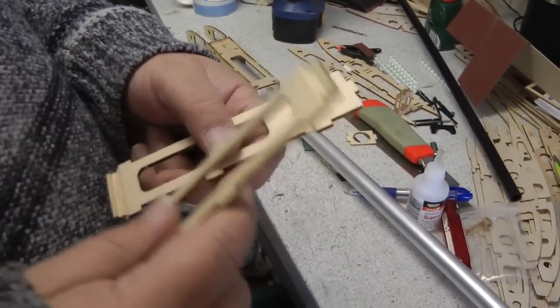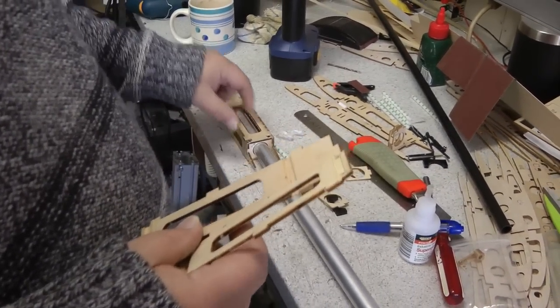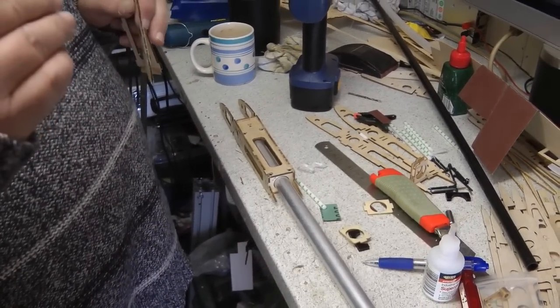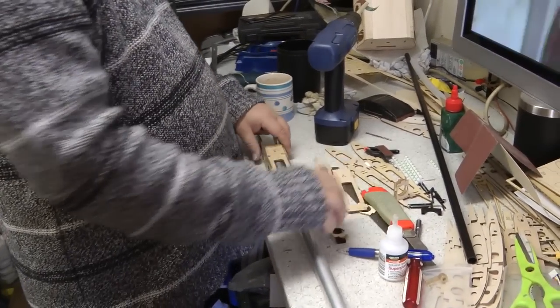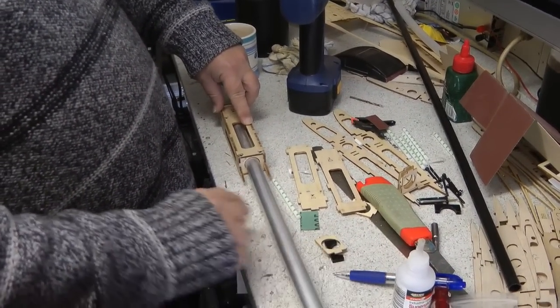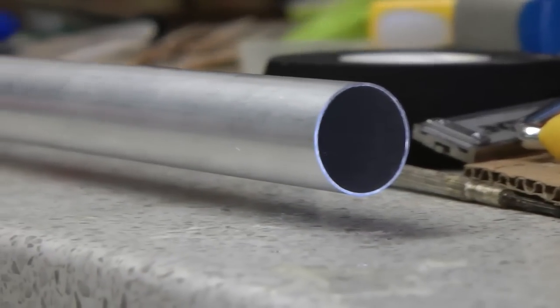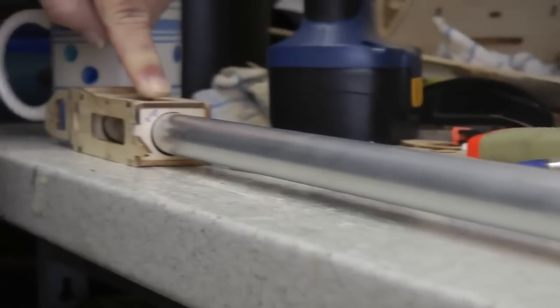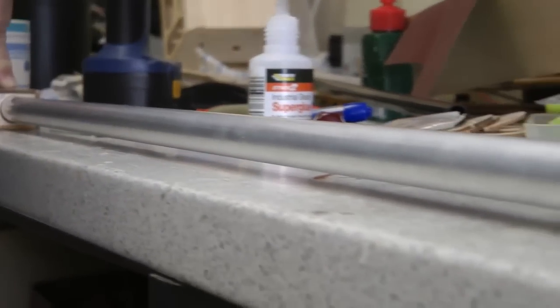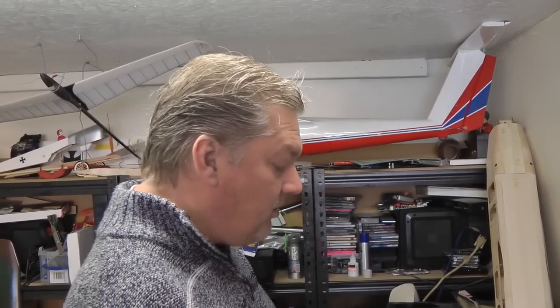When you make these grooves, make sure they are the same depth across the two box assemblies. If they're not, your tail booms are going to be out of line. When you come to make the wing, make up two of these first, get them on the bench, put the assembly together, and check that the boom is basically flat all the way along — parallel to the desk. Make sure both booms are exactly parallel; it'll save you a lot of hassle later on. Don't build the wing and then find one boom is up and one is down.